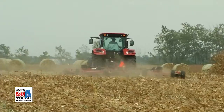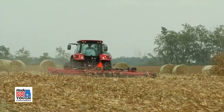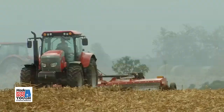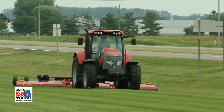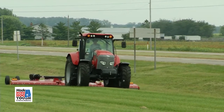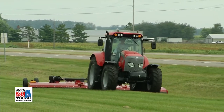Bush Hog's Easy Lube drive lines are quick and easy to service. All grease fittings on the PTO CV driveline and wing drivelines align for quick location of grease points. Since all grease fittings on all drivelines are in the up position every fifth revolution, service time is greatly reduced. The 2820 is Bush Hog tough and designed for years of dependable service.